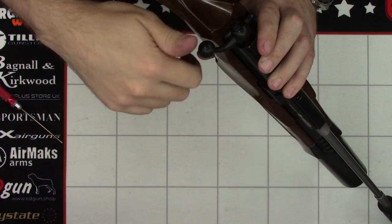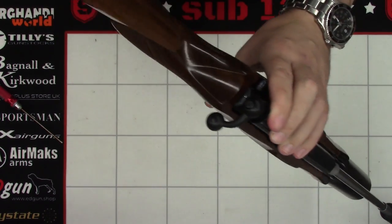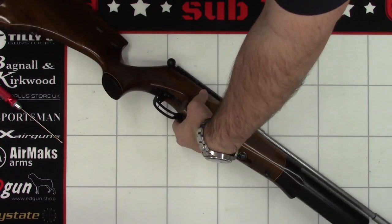The last thing we can do if needed is readjust the position of the bolt probe — using a 3mm Allen key just loosen that off, move it to where it wants to be so there's a nice amount of gap between the stock and the bolt, and then do it up nice and tight. So there we have it — that's pretty much the R10 all put back together and finished.